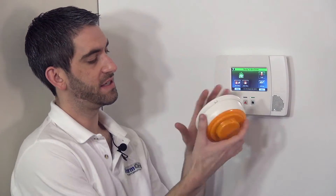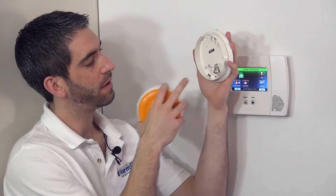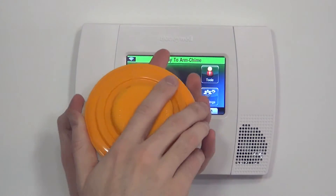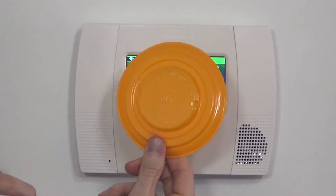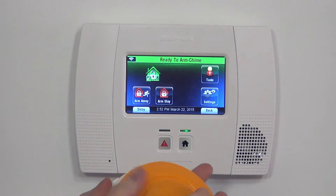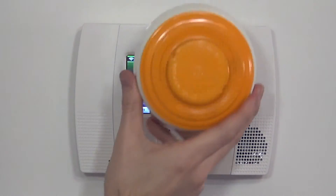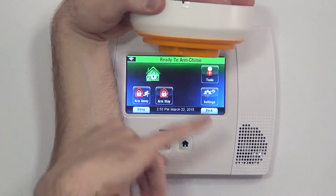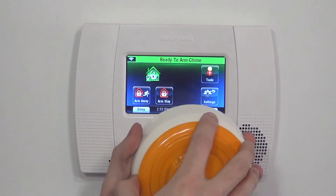This unit consists of a back plate with a tamper contact, which mounts to the ceiling or to the wall. And then it has the smoke detector head, which comes installed with a dust cover. This is just a plastic cover which says 'remove before operation.' It won't allow any dust inside the chamber with this cover snapped on. It's very critical that you remove this before ever using it, because this would prevent any smoke from getting into the sensing chamber. This is a photoelectric smoke detector.